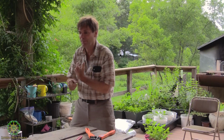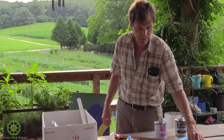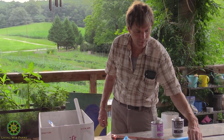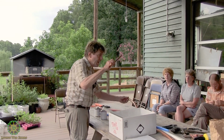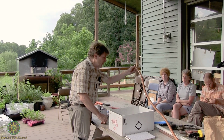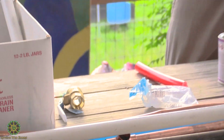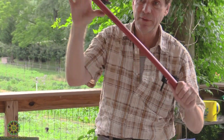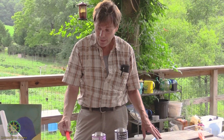We talked about iron pipe, galvanized and black iron. We talked about PVC. We talked about CPVC, which is hot water PVC. We talked about copper, the rigid copper and the soft copper tubing. And we talked about PEX, polyethylene cross-linked plastic piping. Color doesn't make any difference. It's a 180-degree limit at the high temperature. I think it's 100-pound pressure. So that's most houses don't have anywhere near that.